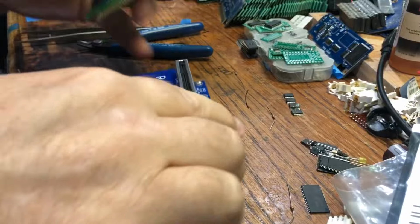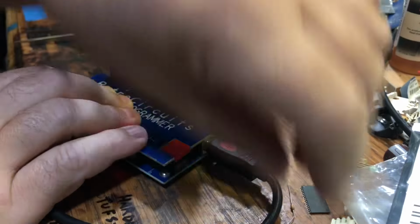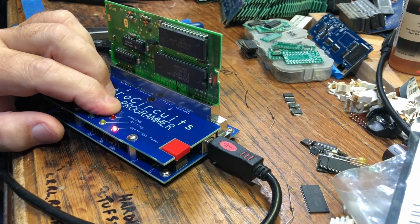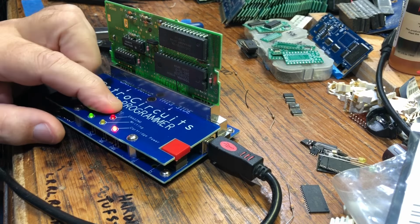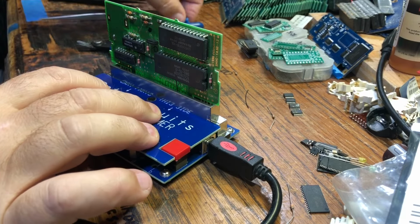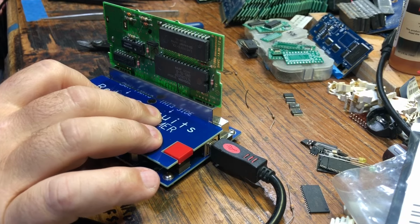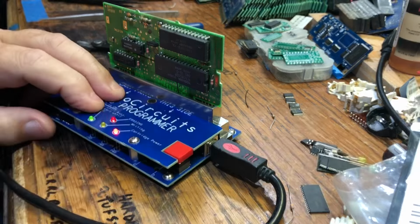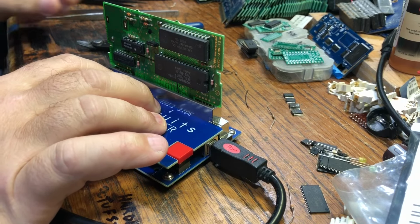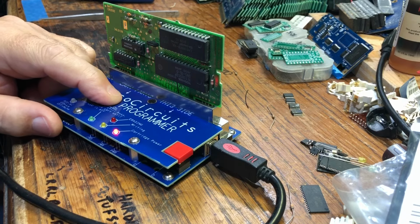Okay, so. Oops. All right, so I've got my programmer here. I'll put that in. Turn it on. All right, so delete, yes. So the programmer, because it's a low map part, a lot of these address pins wouldn't line up natively, because anything above A15 gets shifted over on a low map game, which is what this game is, low map. Well, was what the card is. So if we switch it to low map, then everything should be pretty linear.